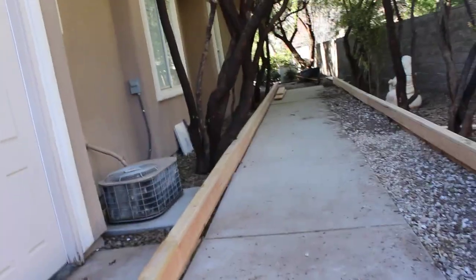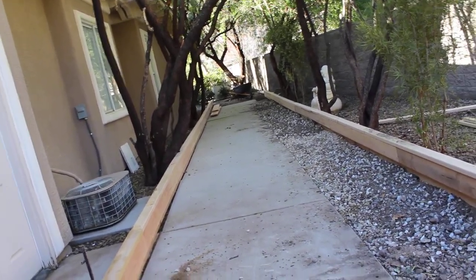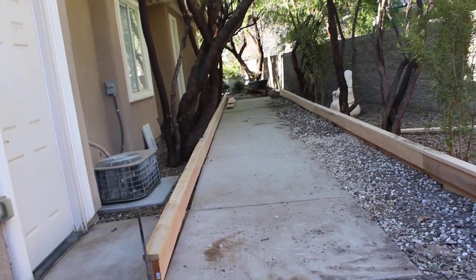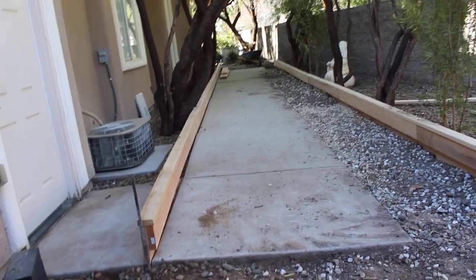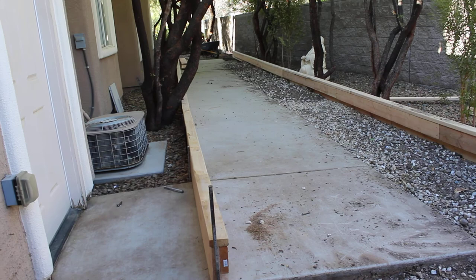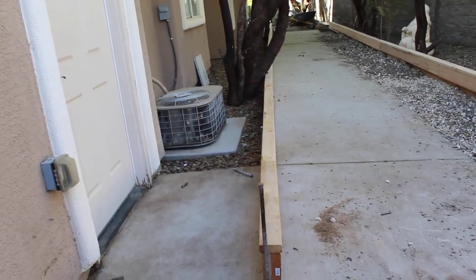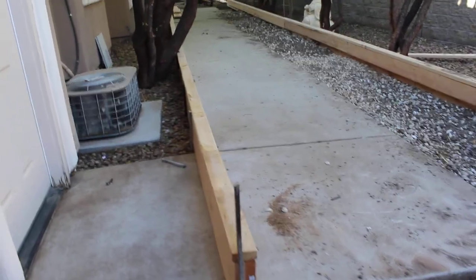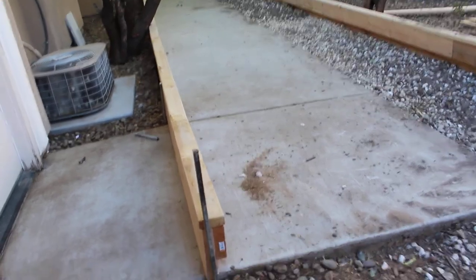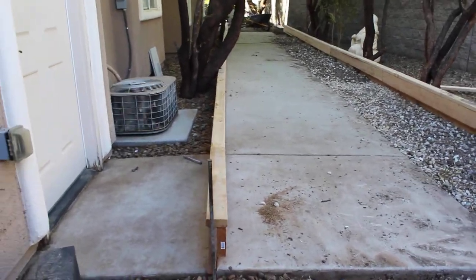So that's the frame, that's the trees. Overall it's a really nice concept — it's a great way to use up some side yard that would have had no great value. I don't have a level with me, but I suspect we need to get a transit to make sure it's actually level. I'm also questioning the point of putting the concrete frame over this piece of the slab at the exit from the garage. I think a concrete saw should have been used to cut a couple inches off here so the frame and poured concrete could tie in better.